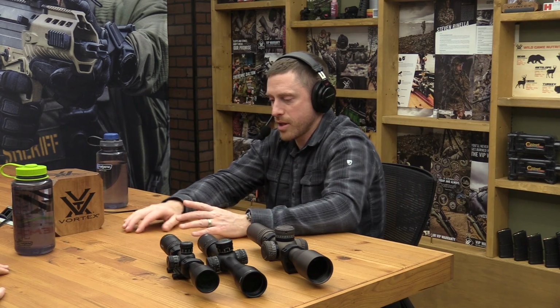One of the ways is putting chrome on the surface, and it's the same way that they do coatings on lenses. Instead of coating with magnesium fluoride or some other kind of anti-reflective coating, they're just using chrome. And so wherever they put that chrome on the surface, that's where you're going to see black. So you've got a piece of glass, and now obviously you can put the black wherever you want. It can have floating features. That's going to be black.